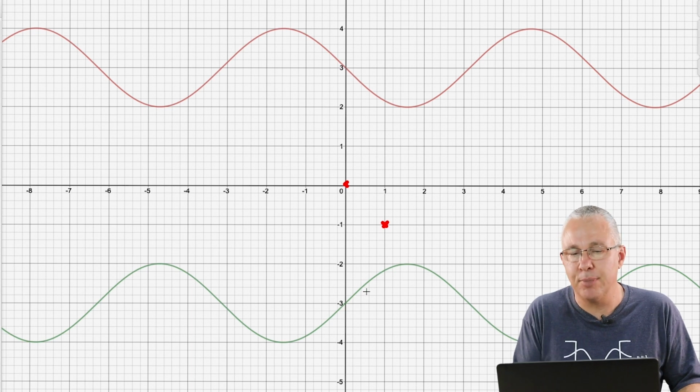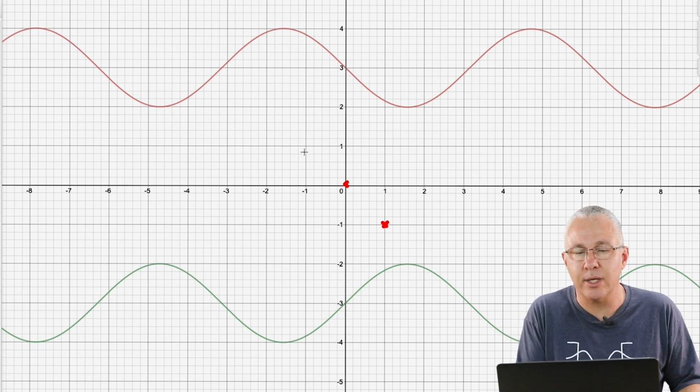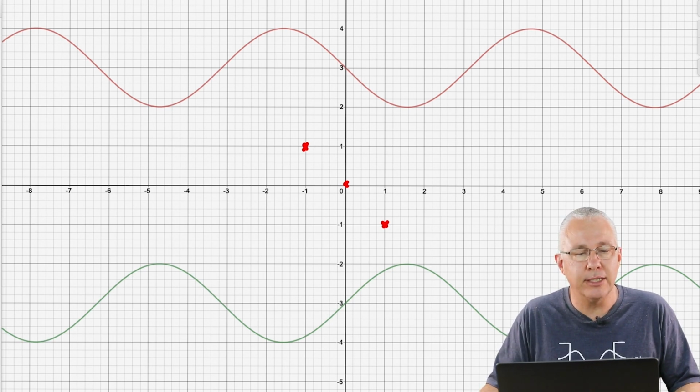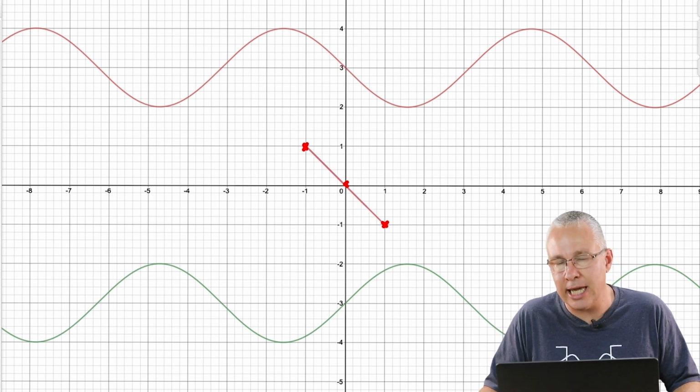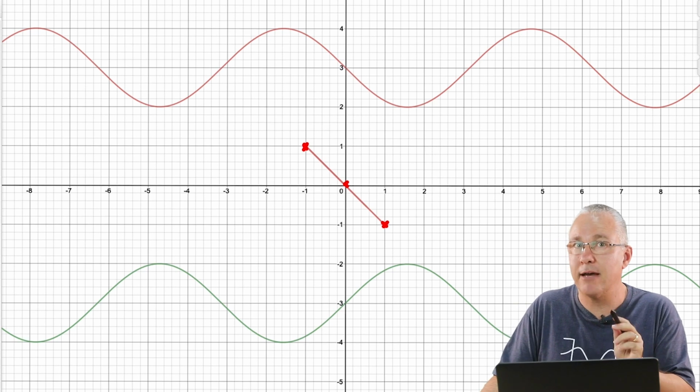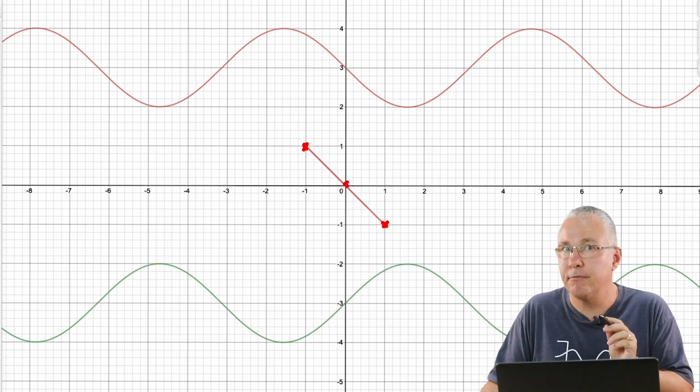Similarly, if I map the bottom one with a maximum 1, this one is a -1, and we get a spot here. And again, if we add them together, we're going to get a pattern that looks like this, a straight line again, but down the top. So this tells us two signals are out of phase, even though they have exactly the same frequency.